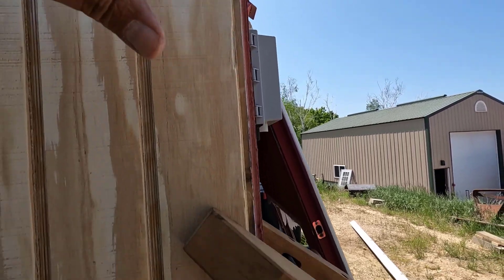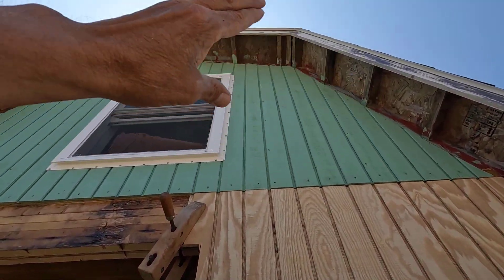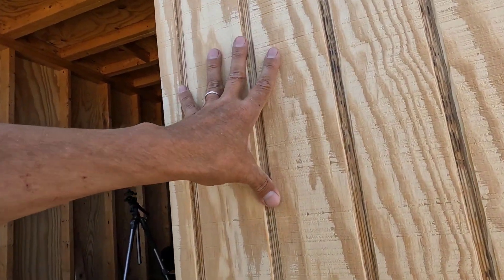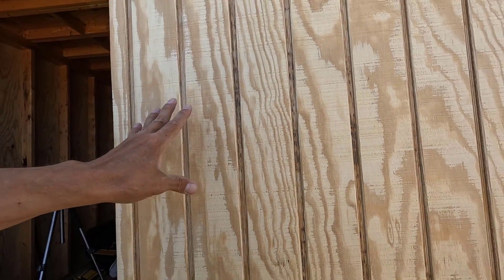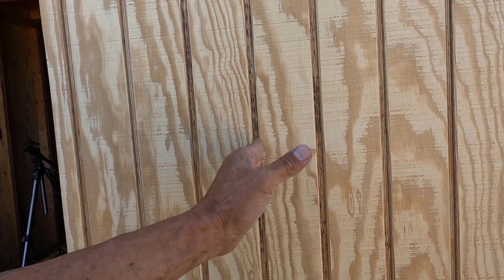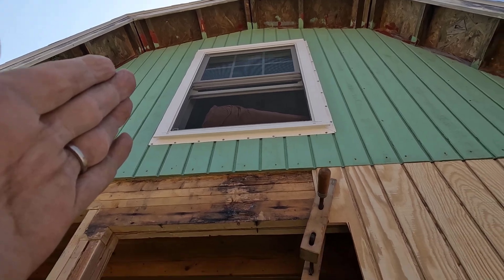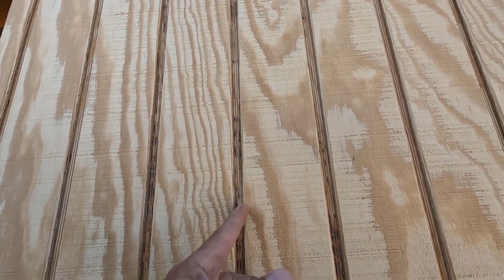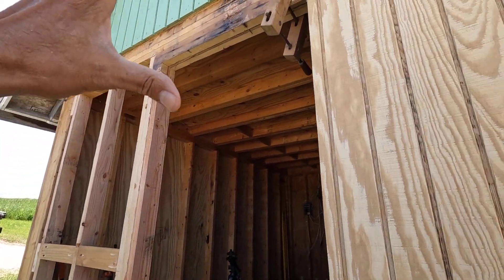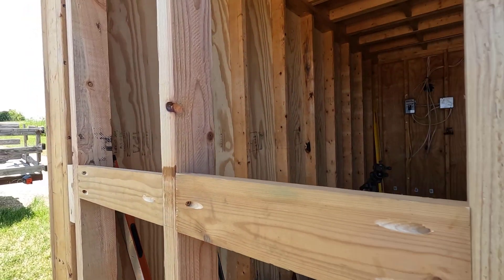It's right around a half inch. The reason for that is in order to get that template up there, I cut that top skin off, took that off, and laid it out on these panels on the floor over in the shed. But when I laid it out, the center was coming a little bit off of the center of the profile, so I just moved it over and aligned it with the center. You can see up there the center is right in the center of the building, but I shouldn't have done that. The center should have been right on the edge like that. That would have moved everything over a little bit. It's not going to make any difference because we have one panel on the side of each door, so I just have to know where to nail and nail in the right place.